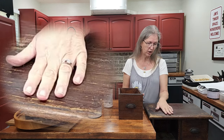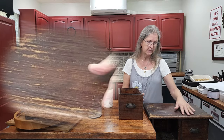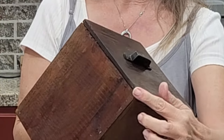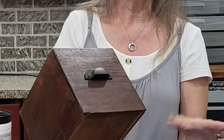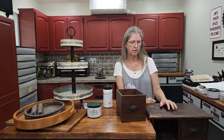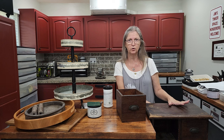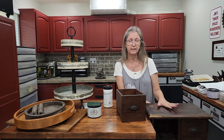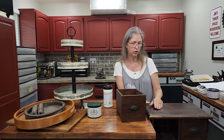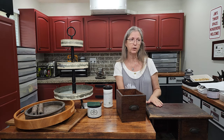On the top of this piece there's finish, missing finish, scrapes, gouges, and chips all over it. For instance, down here there's a piece missing off the front. Yes, this is a somewhat rustic piece, but it can look a lot better with a little extra prep. If I sand this down to a smooth finish, I don't have to sand it to raw wood, but in this case I do need to sand it. Remove all the sanding residue, de-gloss it, and then start painting. But before I do, any divots or gouges have got to be filled with wood putty.